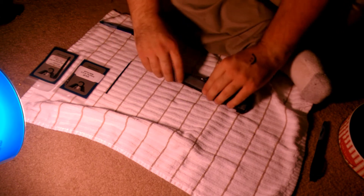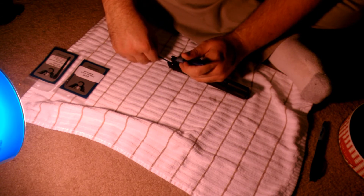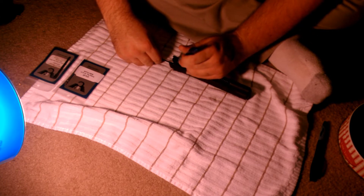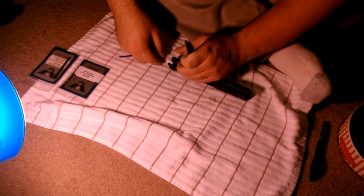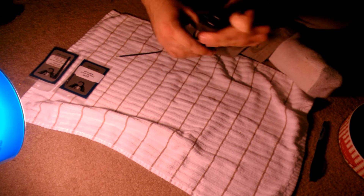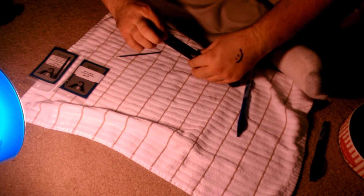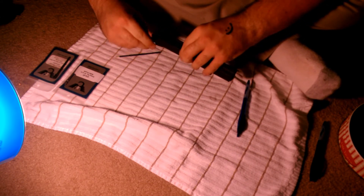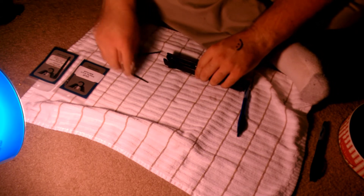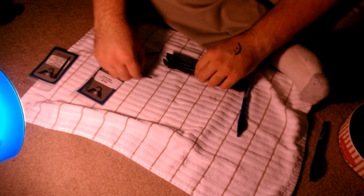We will insert this ballpoint pen inkwell into our firing pin channel, press the plunger, and our firing pin will come right out. There's our firing pin. Notice that it is almost identical to the Wilson Combat one, except I like the color — the color is going to be nice and different.